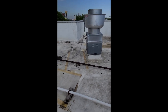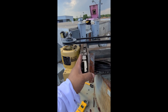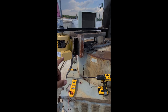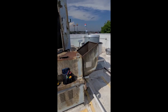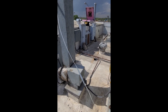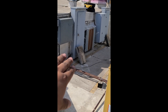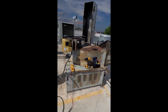This vent hood job is coming to an end. I loosened the tension bolts and eased the belt, then took another amp draw and got 3.0 amps — a little bit better. It's not going to overload this motor and it'll last longer. This customer is going to be very happy; they've been complaining for two or three days. Just make sure when you finish these jobs you put your high-tech security system back on the breaker so nobody gets back in there. Alright, wrap it up — thanks for watching.